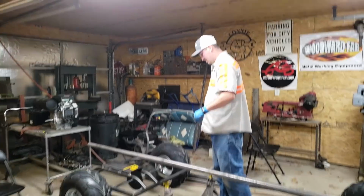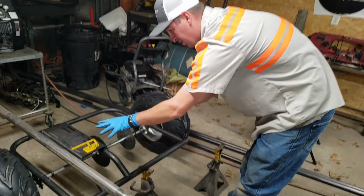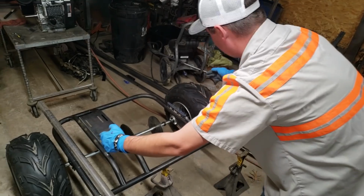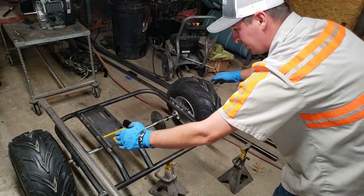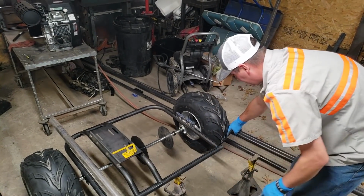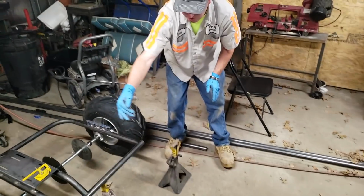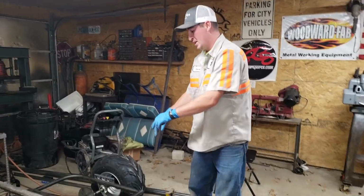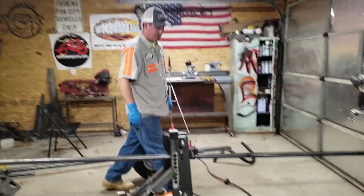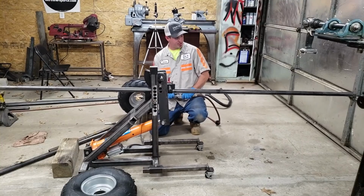The hoop is going to come right here. It's going to have attachments on it for the rear swing arm. We want the hoop to come through here and get about midway of the tire, which is what we want to keep on the outside of the tube when we bend it. I also want these to kick in slightly as it goes up, so we want to do about a 105 degree bend on each edge. So let's get some tube bent here. Get the preload set.